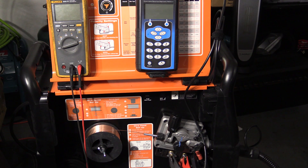Definitely a lot more power than I got during the first testing. The big limitation is just the wire feed speed — if the welder had a higher wire feed speed output you might get a little more versatility out of 030 wire. But as it stands, get yourself a roll of 035 and you're going to get a pretty darn good output out of it.